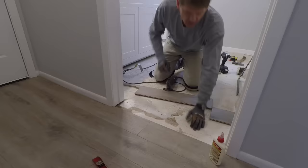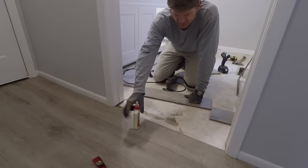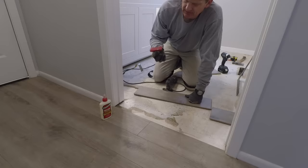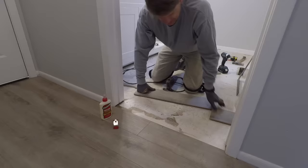This is snap lock floor — this is a laminate, no different than vinyl products. You want to make sure you have some wood glue — that's important in this particular application. The other thing you want to have, though it's not absolutely necessary, is a little three-inch block plane, about five bucks at a home improvement store. You can actually do this with a utility knife too, but the block plane makes things real easy for what I'm going to show you.